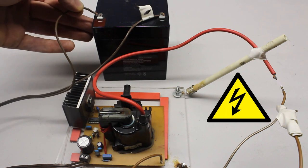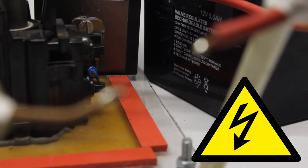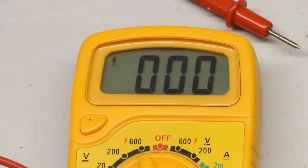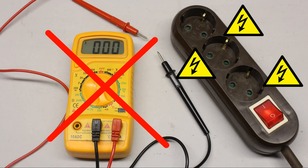In general, if you are untrained in handling a digital multimeter, you should never examine circuits connected to high voltages. Never touch blank metal in active circuits, because even circuits with a low input voltage can generate high voltages if inductors are placed inside the circuit. Only use voltages up to 12 volts for your own experiments around digital multimeters.